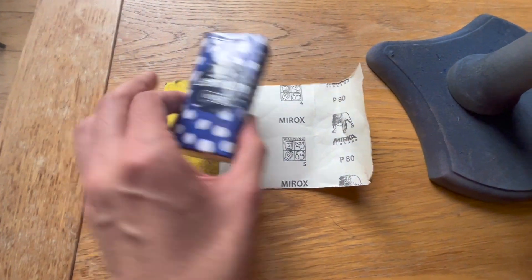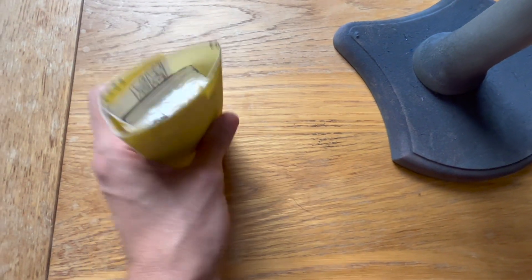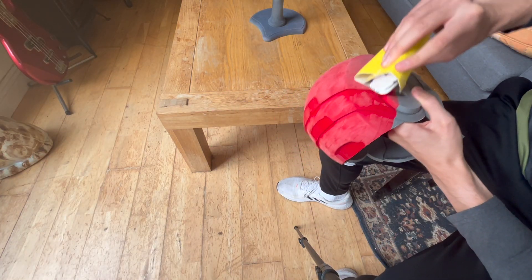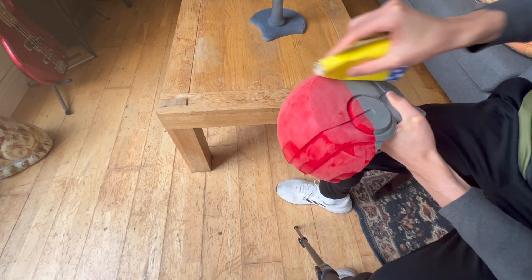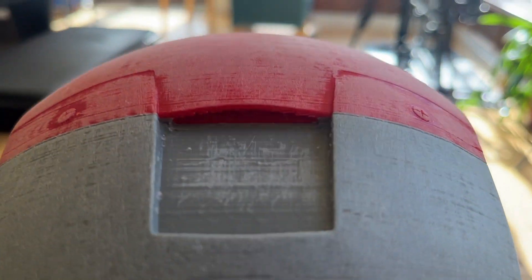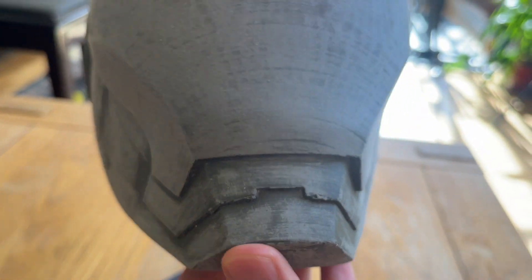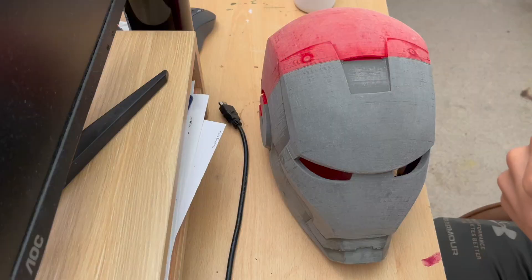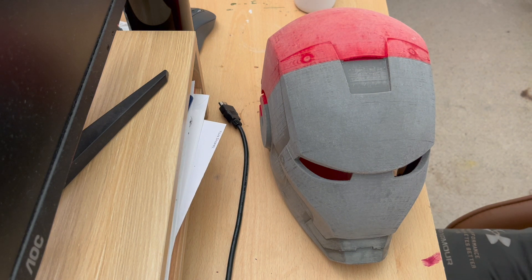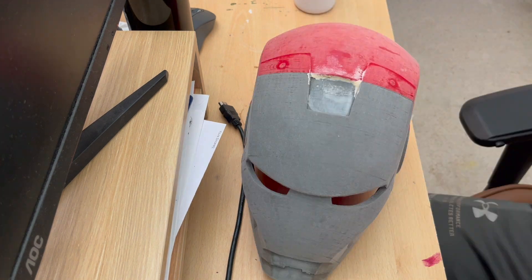We then went over it again with some old-fashioned hand sanding for some of the parts the machine couldn't reach, which I used 80 grit paper. A little pro tip here is just to wrap the sandpaper around an object to make it easier on your hands. After sanding, you can see from the original print that there's a few surfaces that aren't exactly smooth or might have been where the 3D print had support attached, so to smooth these out or fill in these surfaces we use generic wood filler. For this you simply lather on a layer of the wood filler onto the areas you wish to fill or smooth out, and you're better off using too much than too little since you'll be sanding it down. Just be sure to do it as quick as possible as the filler begins to harden as soon as it comes out.